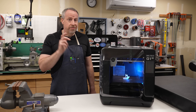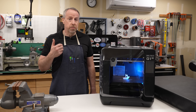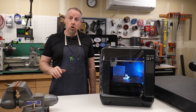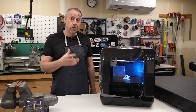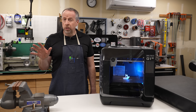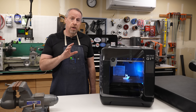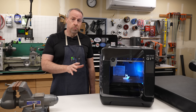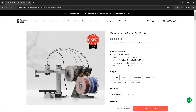So should you buy this printer? I think a better question is who is this printer for. I think anyone could pick this up and use it as their first 3D printer — the bed leveling, the purge system, and the pre-configured profiles in the slicer are good enough that you could have success right out of the box with no prior experience. For more advanced users looking to print engineering materials, the hardened steel nozzle and the heated chamber make it a good machine for that application. If you need a larger build area or want to print with multiple colors or multiple materials like breakaway support, it might be worth paying a little more for the Bambu Lab P1S or even the X1 Carbon. On the other end, if you're just starting out and don't want to spend this much, the Bambu Lab A1 Mini has a smaller build area but for less money you still get a solid machine that works right out of the box, with the ability to add an AMS for multi-material printing later.